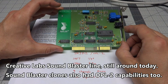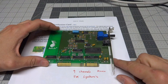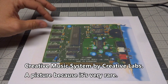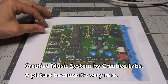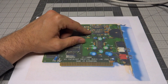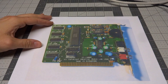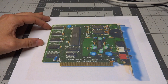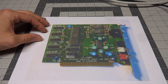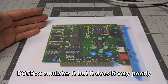If you were playing a PC game any time in the 90s, you were hearing music most likely coming from one of these Yamaha chips or a simulation of the chip. Now, at the same time the AdLib was out, there was a competitor card — the Creative Music System. I've never actually seen one of these cards, but it was originally released in 1987 and used Philips SAA 1099 chips to produce sound. It had two of them, resulting in 12 channels of square wave sound in stereo — six channels per chip. While the card wasn't that common, a year after its release in 1988 there was a Game Blaster version sold in Radio Shacks, which was basically the same thing but slightly cost-reduced. Unfortunately, the CMS or Creative Music System standard didn't live very long, so many people have never heard it, including myself.